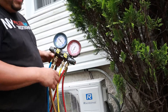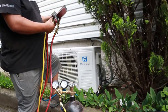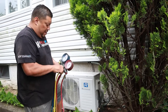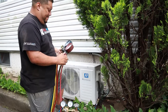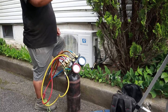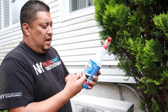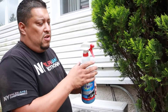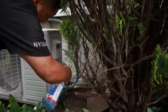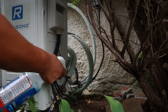I personally like to do double the pressure — if there's a leak in there, it's going to show. So right now we're at just a little over 300 PSI and I'm going to shut it down. Now it's an old-fashioned leak check. You can use soap and water — as long as the consistency is a little heavy, you want some bubbles. So we'll check it out. Let's hope we can find this pretty quickly. Hopefully it's nothing major.